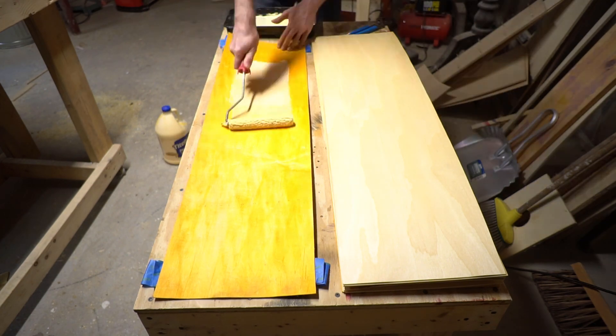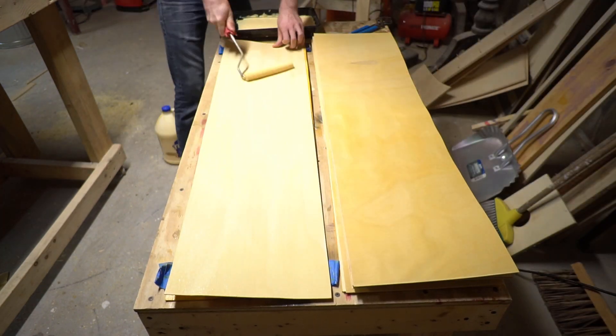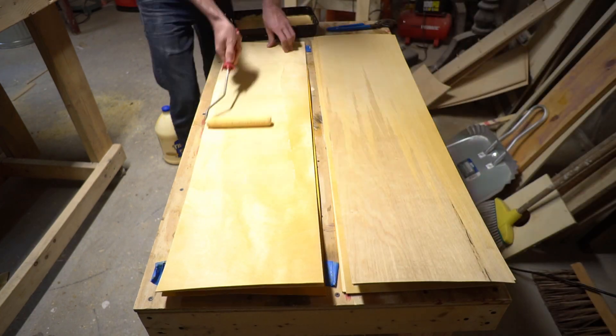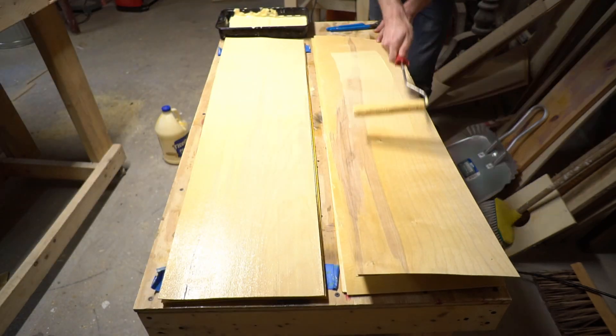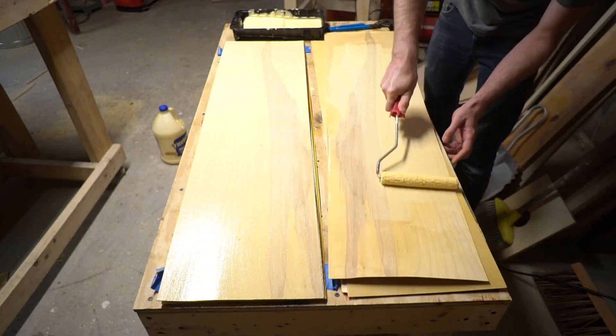So let's start by looking at the layout. This is going to be a 9-ply board, same as my first one. The first deck I made was a combination of bamboo and rock maple with just a little cherry thrown in for flavor. It worked pretty dang well, but I found it a bit stiff and heavy, so this time around I'm using rock maple for the outer layers and cross grains, and the rest of the board is going to be birch. I'm also making the deck a bit shorter to reduce the amount of mass.